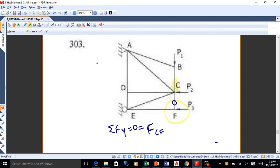It's gone. Okay. You said there is pressure on joint F, but it's in the X direction. Yes, right. So you'd still call it a 0 force member? Well, CF is in the Y direction. So there's an X force on the joint, but EF is not 0. Right. But a 0 force member, that's like CF is a member. Oh, CF is a member. Yeah, which is a beam or a column or whatever. So I think that's about the terms that you use. A joint is where members come together. A member is like a long, thin piece of metal. Okay.